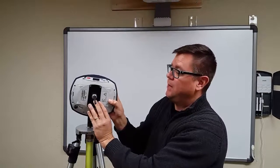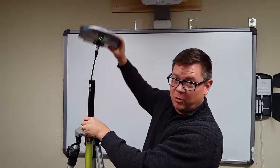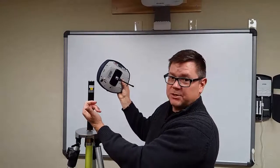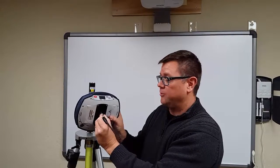It goes here. It's a 2-watt radio, send and receive. The antenna itself is actually designed to go into the pole. This is for the base setup. You've also got a 2-meter pole that comes for a rover. On the base, there's a slot for the radio cable to go into should you want to utilize an external radio with a more powerful transmit rate.